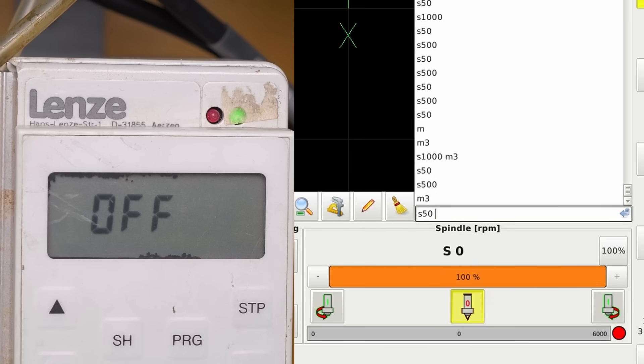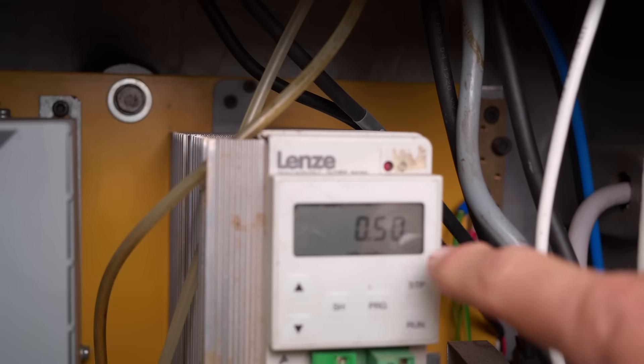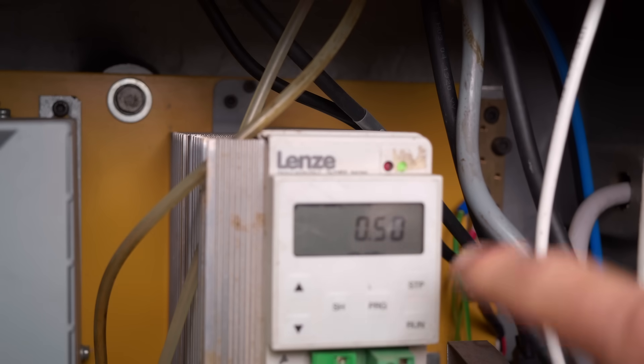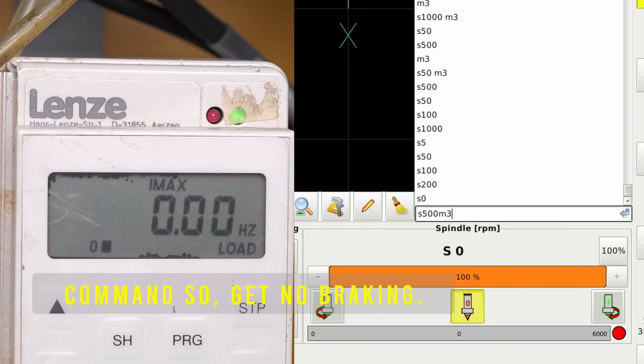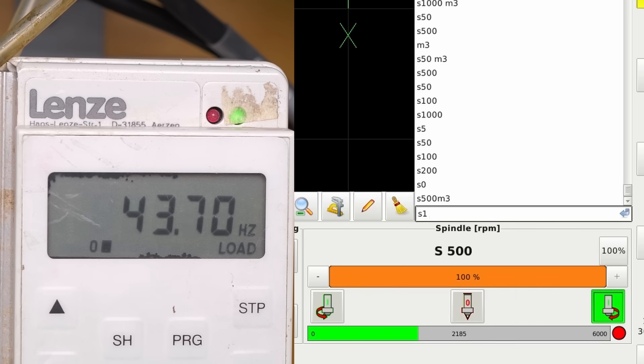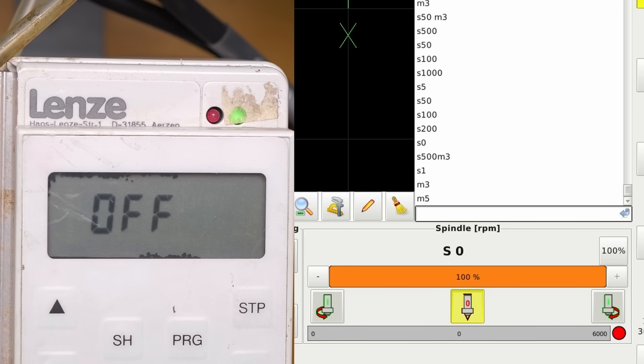My scaling is a different issue so don't worry about the actual speed numbers, but I start the spindle at 50 — it's turning very slowly. Going up to spindle 500, you can see when I come back down from 500 to 50 the brake is working. Playing around with the braking ramp, which is C13, I've currently got it set to brake down from maximum speed to nothing in half a second. If I command speed S0 it goes off. If I command spindle speed 1 the motor actually stops but it's still being powered. If I now go to M5 to turn it off, it goes off.